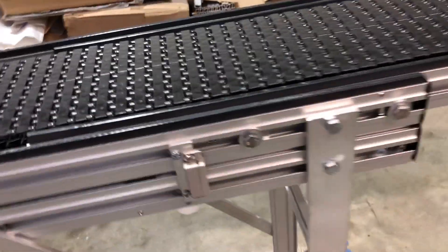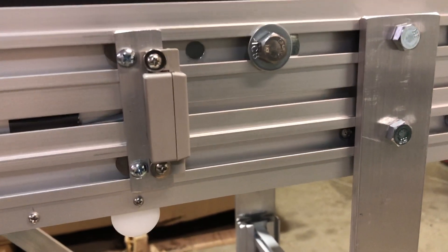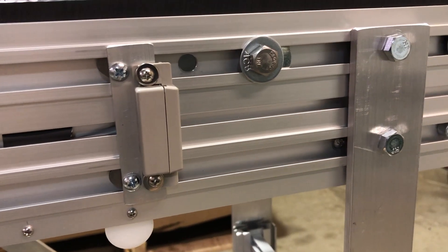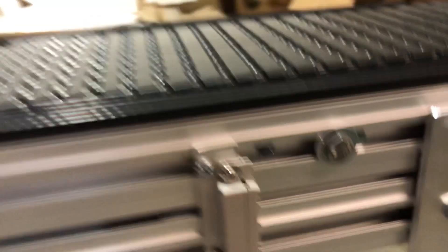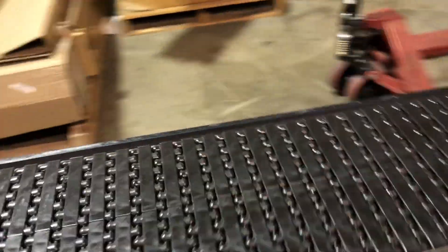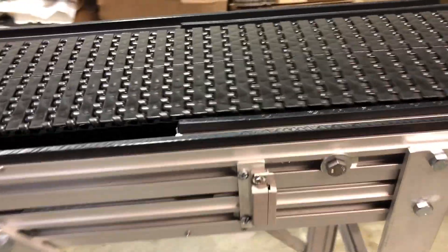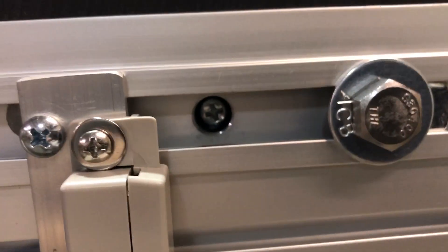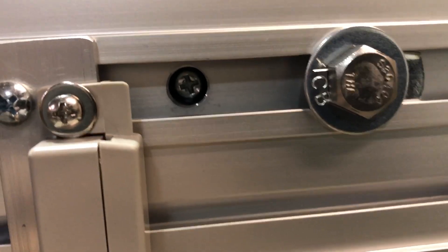Well, we provided for that. On this side you can see a proximity switch — basically when a magnet gets near it, it goes on. When that gate is all the way out — I'm going to pull it all the way out — you can see that in that hole there was nothing. Now it's all the way out, and look and behold, there's a screw in that hole. That screw holds the latch and the magnet.